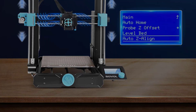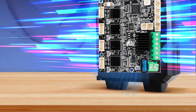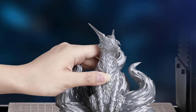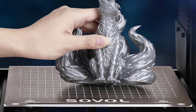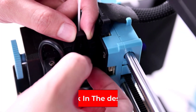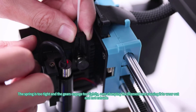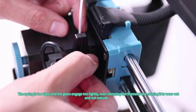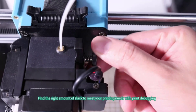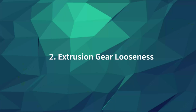It's not completely hands-off, though, something newer systems at this price point are starting to offer. The one thing to watch out for when considering the SV06 is its poor performance with flexible materials. The system's direct extruder with planetary gearing performs great with rigid filament, but flexibles tend to get caught up in the gearing and jam. Given the all-metal hot end, you can still use more rigid high-temperature filaments than is typical for machines in its price range. The SV06's TMC2209 stepper motors are remarkably quiet, making for a tidy home printing solution. It's an excellent machine suitable for enthusiasts looking for something hassle-free or for beginners who want to tap into the community experience of a popular system.